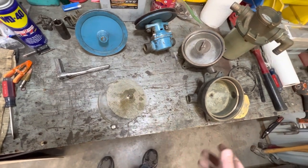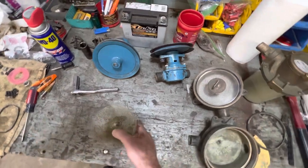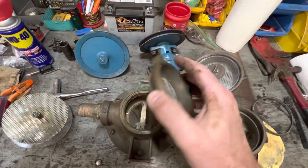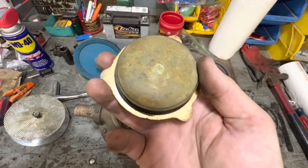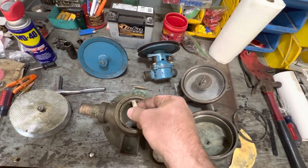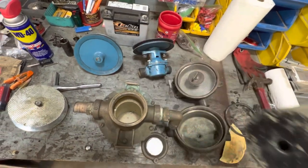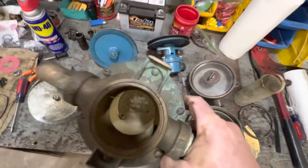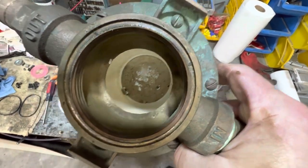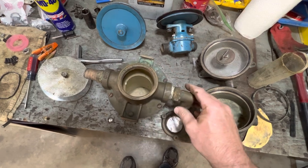It's real simple — just take a few minutes, make sure your strainers are in good shape and you're good to go. This one is a slightly different style for my generator — basically you've got a big lid with a big O-ring that goes on there, and we'll replace that O-ring as well. It's got a strainer basket. We'll clean everything up, clean the bottom, and also clean all the debris out and the plexiglass so you can actually see any contaminants inside.